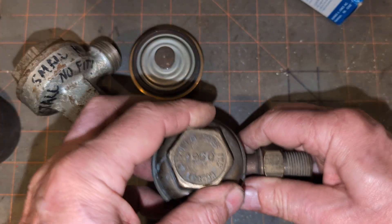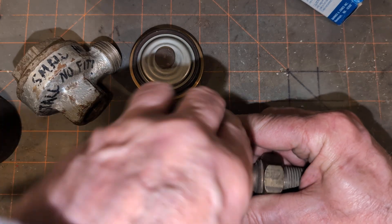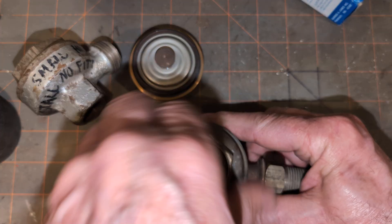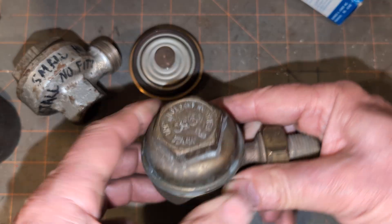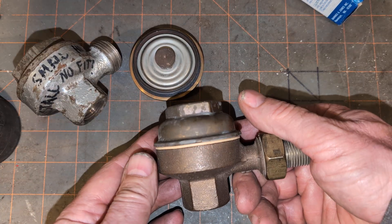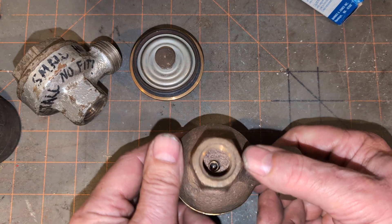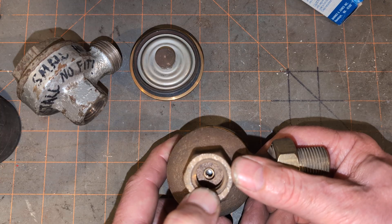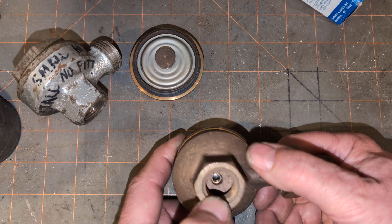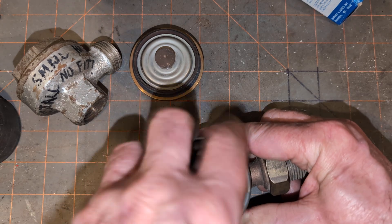You can see I have to push down for a bit and crank it home using an adjustable wrench — I would hold back on that with another wrench and tighten her down, and your trap is rebuilt with Barnes & Jones. The one disadvantage of using the Barnes & Jones is you've restricted the outflow, and so you've restricted the capacity of the trap to handle air and water, but it is repaired.